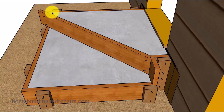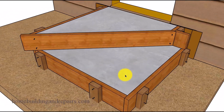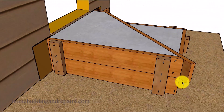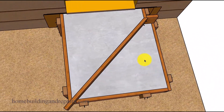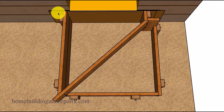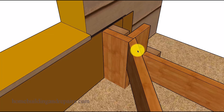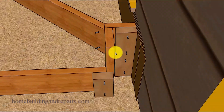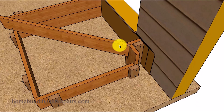We're still going to meet in the corner and form everything up relatively the same way. Keep in mind that most building codes don't have anything to do with the outside corners, which can also be dangerous. In our example this is going to be 38 inches wide, we come out six inches and then six inches this way. This board will be six inches longer than in previous examples, and you'll be forming the inside corner a little differently. And as always, if you come up with something on your own that works better, use it.